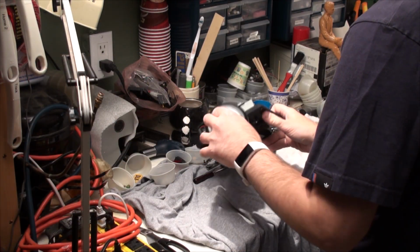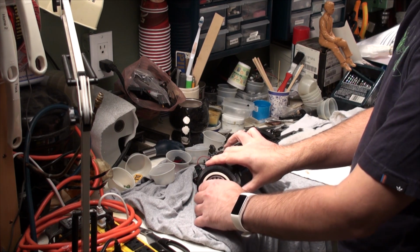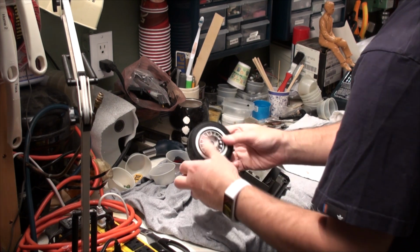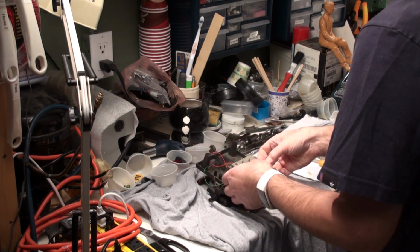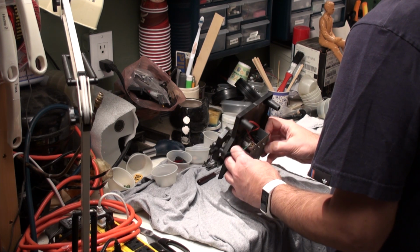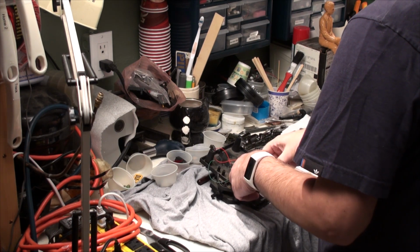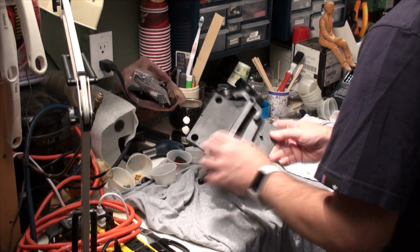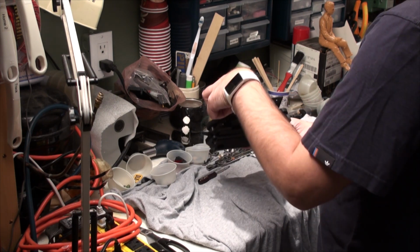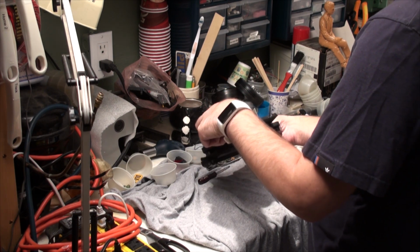I removed the front wheel assembly from the car to determine how best to integrate the steering servo to steer the front wheels. I removed the wheels from the front axle stubs and began. The original steering mechanism was composed of a DC motor and a series of gears connected to one large gear that had a metal shaft on it. This shaft is connected to the tie rod of the steering assembly. When the gear would rotate, it would move the metal shaft in an arc, pushing the tie rod left or right as desired to steer the car.